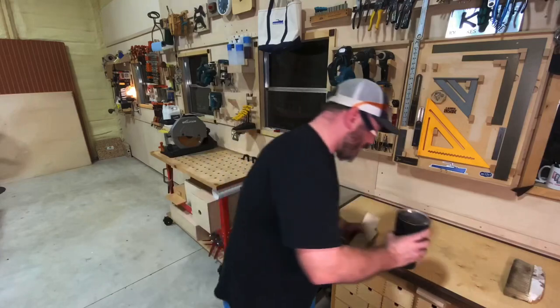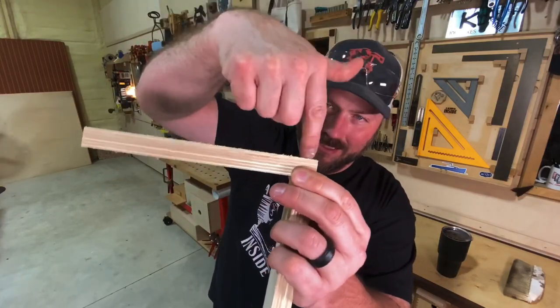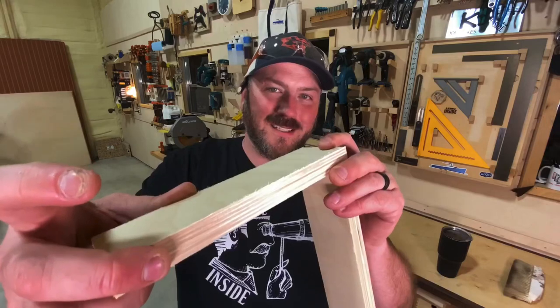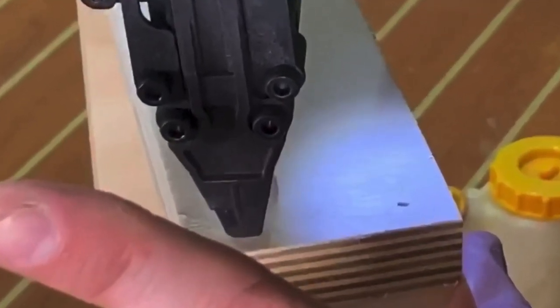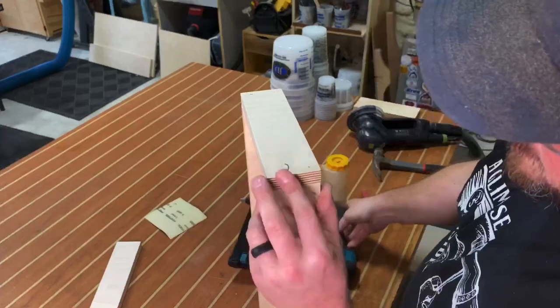I'm going to explain it now. I always do this technique because bad things can happen if you don't. When you join two pieces of wood with a brad nailer and shoot the nail in, sometimes you may think leaving your finger there is okay — but it's not. Every once in a while a brad nail can go squirreling on you. So I always lift my hand away, shoot the nail, and then put it back down. That would have hurt. I ended up pulling that nail out with a pair of pliers and just kept moving on — no problem at all.